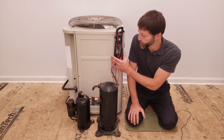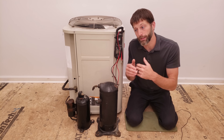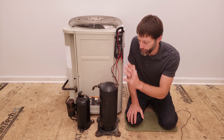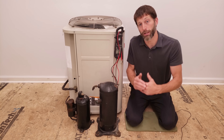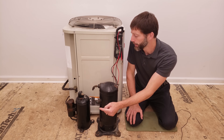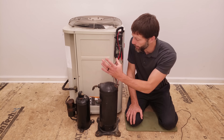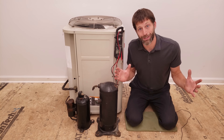I'm going to show you how to measure the windings with a multimeter to see if you're shorted to ground, if the windings are open, or maybe the thermal limit is open. I want to go over the different tips and show you a cut-open scroll compressor that actually is burned out. We also have a rotary compressor we're going to be checking in a mini split unit — that's a three phase compressor versus a single phase compressor. And then we also have a reciprocating compressor inside this outdoor unit.